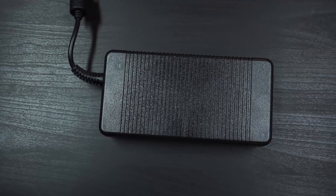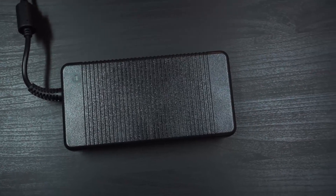The HD Plex 160 is priced exactly the same as the Pico 160 XT at $45. At that price it is a great value, especially when you factor in that you can get cheaper 19 volt bricks than 12 volt bricks. I have mine paired with a 230 watt HP brick, which is more powerful than the kit I bought for the 160 XT with a 192 watt power brick, and it was also $15 cheaper.